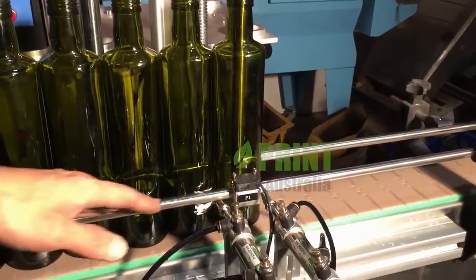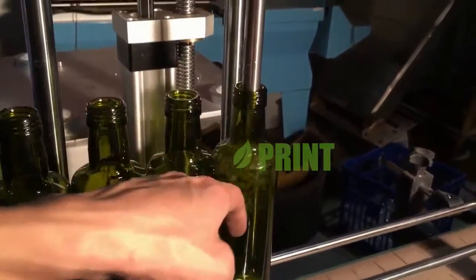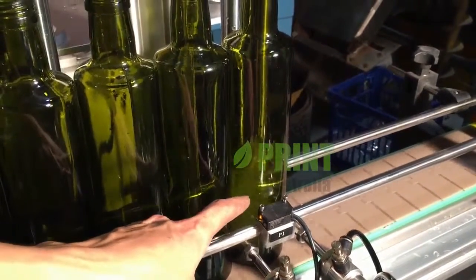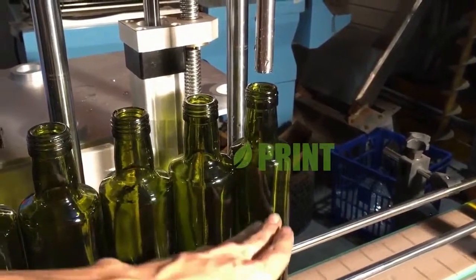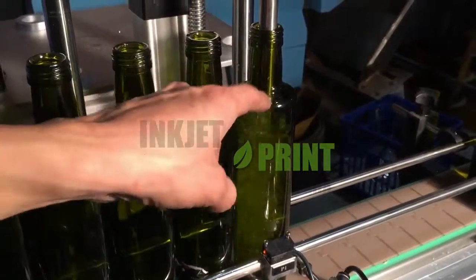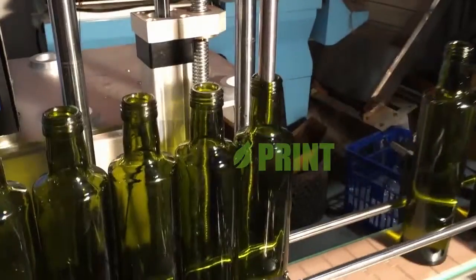Depending on your liquid, you can decrease the filling speed to lower it for bubbles. So on the water we are running on, we put 80% speed and for the last 10% we are filling at 10% speed. See, the 10% at the end.